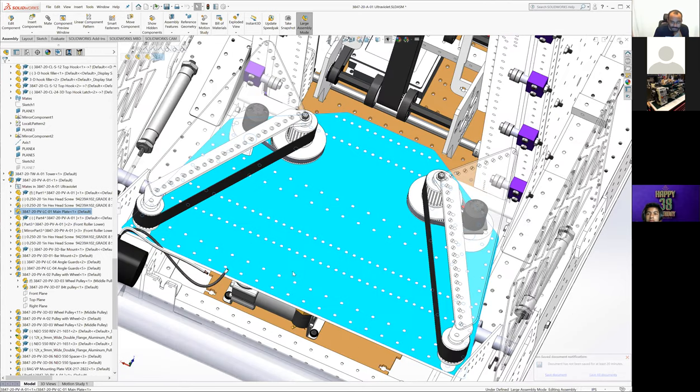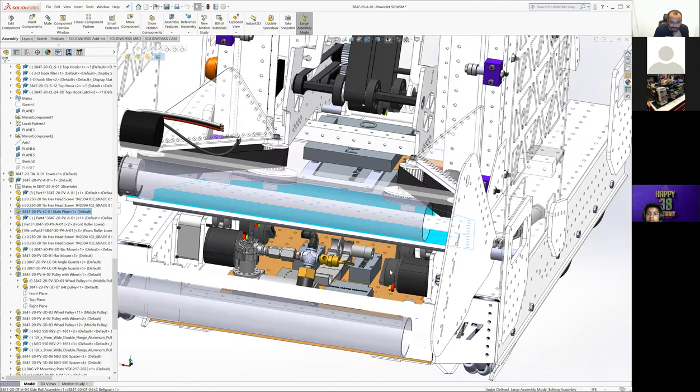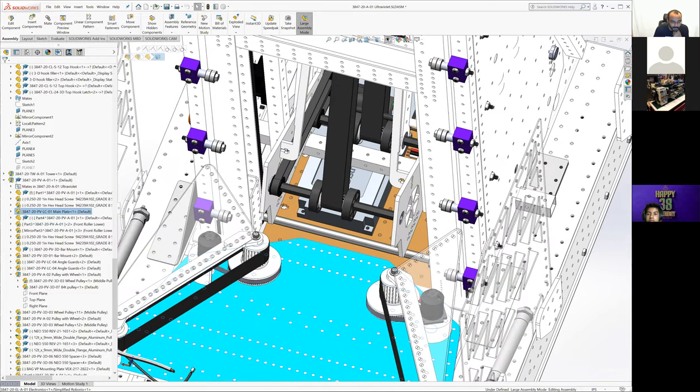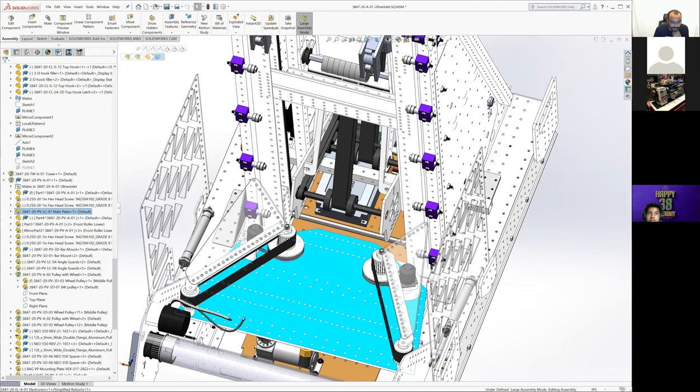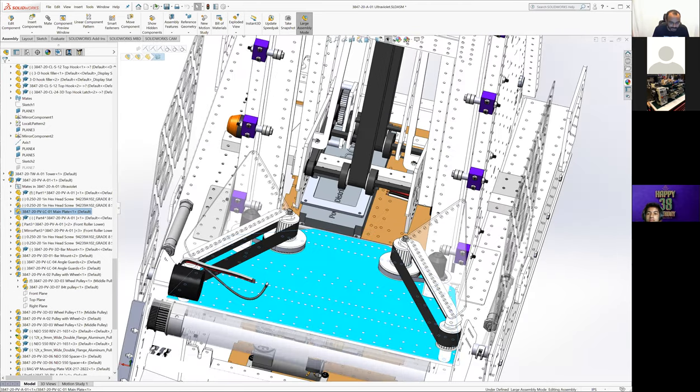This whole plate is just zip tied down, so when we need to get to any of the electronics or the drivetrain gearboxes that are under it, it's just unplugging the two Neo 550s, cutting some zip ties, and the little shields on the side, and this whole assembly can get pulled out without pulling off the intake or anything like that. So we can pull this pretty easily if we need to. We didn't design it in any way to tip up anywhere. If we just cut the front, you can get a little bit of room by tipping it up. But really, if you have to work down here, you basically have to pull the whole thing out, which isn't that bad.